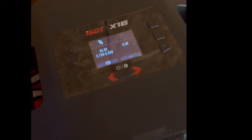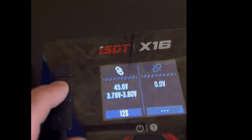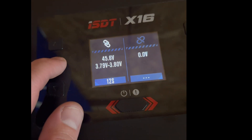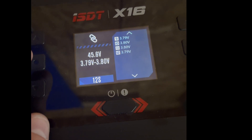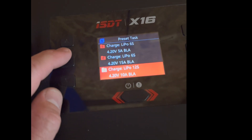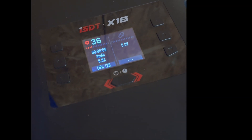I've got it plugged in after a completely full flight — my timer hit three minutes and I stopped. This is the first full, full-on flight, and you can see it stayed pretty balanced; a couple of cells are a hundredth of a volt off, and it's actually still warm from the flight. At this point, after the 10 cycles, I'll start charging at 2C.